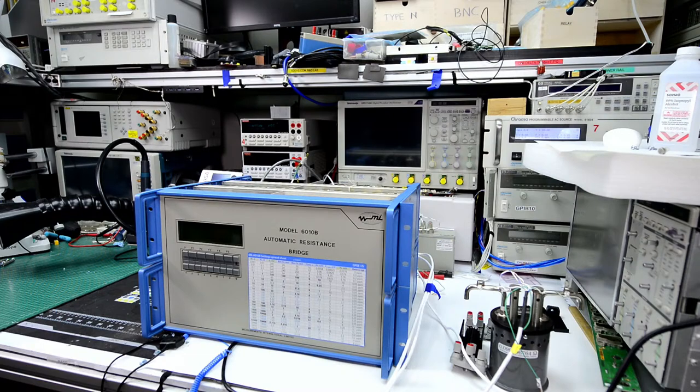And when I was switching the resistor to 0.01 ohm, what happened is I got some small electrical shock from one of the terminals, and that was very unexpected because this bridge can source up to 30 volts on open circuit, but there was very low current, and it was also testing low resistance values, so I wasn't expecting any high voltages over there. And that was the first time it ever happened, so I thought, okay, this is strange. I thought maybe there is some leakage from mains on the metal parts of my air chamber. So I took the Fluke 87 and measured AC voltage between the chamber, some different resistors and cables, and everything was fine. Everything was zero, or there were a couple millivolts, just pickup noise.